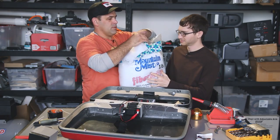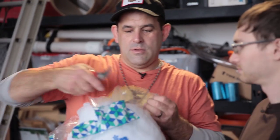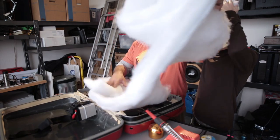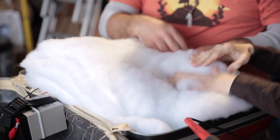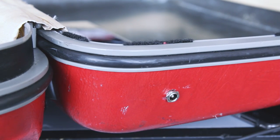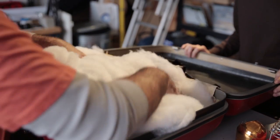We're pretty much done with the build now. A couple tweaks: we grabbed a bunch of polyfill — this is an old-school subwoofer speaker tuning trick where about a pound of polyfill per cubic foot tightens up the low end and makes the enclosure behave larger than it is by slowing down the airwaves. The end result was it picked up and tightened the low end and made it much punchier. I also put a little bit of material every few inches all the way around the rim, and that actually stopped the case from vibrating — especially when you turn the volume up.